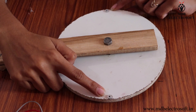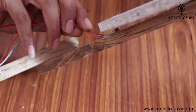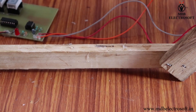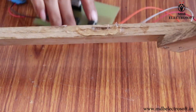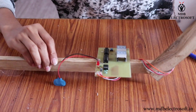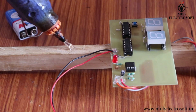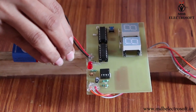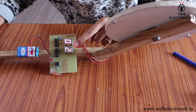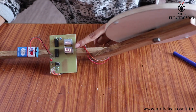Just below the magnet on the rod, we have to attach the sensor. Apply glue and attach the sensor, keeping in mind that the sensor should face the magnet. On this rod we also have to attach the circuit, so apply glue and attach the PCB circuit. Now take a 9V battery, attach it close to the circuit, apply glue, and attach the battery. Connect the battery to the circuit — initially the display will show zero. Rotate the wheel; when the magnet is brought close to the sensor, there is a change on the display. The numbers on the display represent the distance in feet.